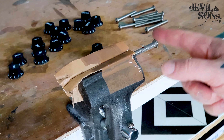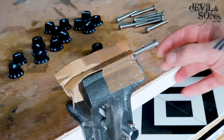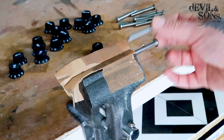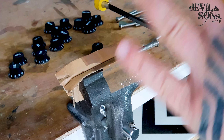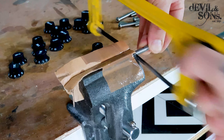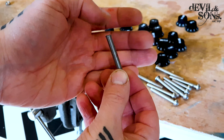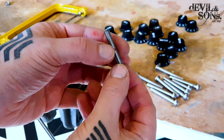Here I've put my bolt into my vise. I've got some cardboard here just to help clamp it. The bolt is only very slightly in the vise so it's going to be quite hard to cut. I'll do it in a pose for the camera — I'll speed it up. Here I've got the bolt where it's been cut. You can see the end has a little lip on it, so I'm going to have to file that down just to help the nut go on it.